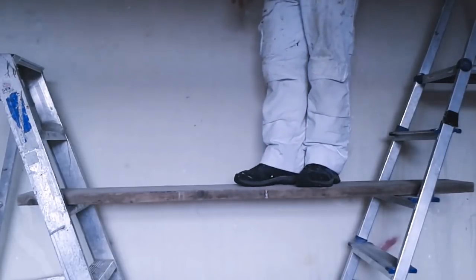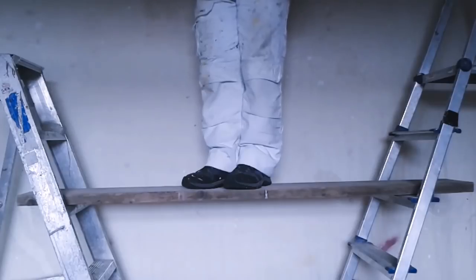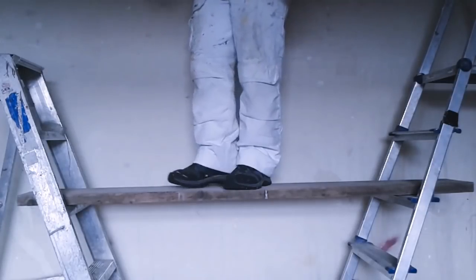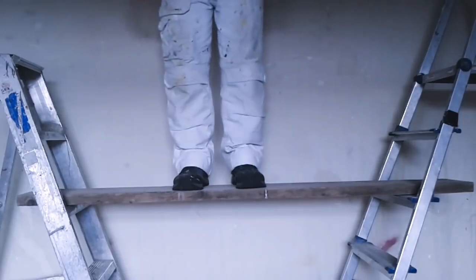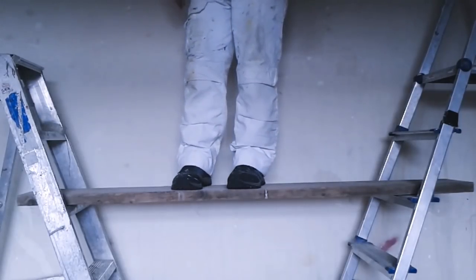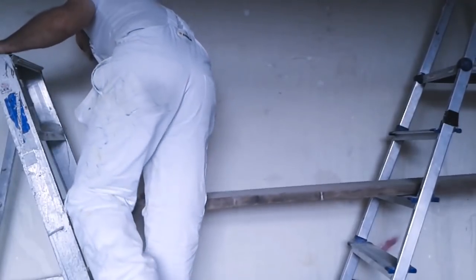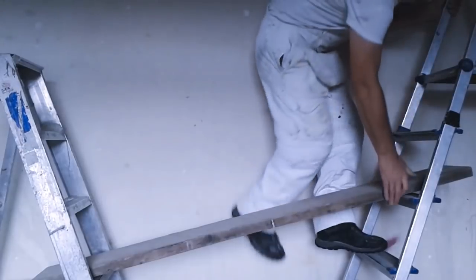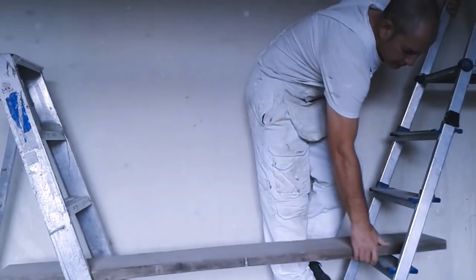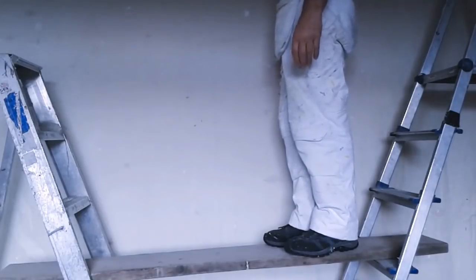Because these are temporary, you want to be able to move around. Clamping it will just slow you down. For instance, if I just wanted to drop this plank now, I don't necessarily have to go all the way down — I can simply drop myself down and I'll be able to work and carry on.